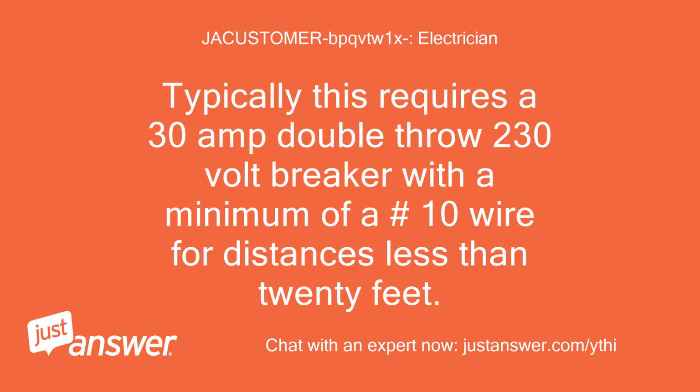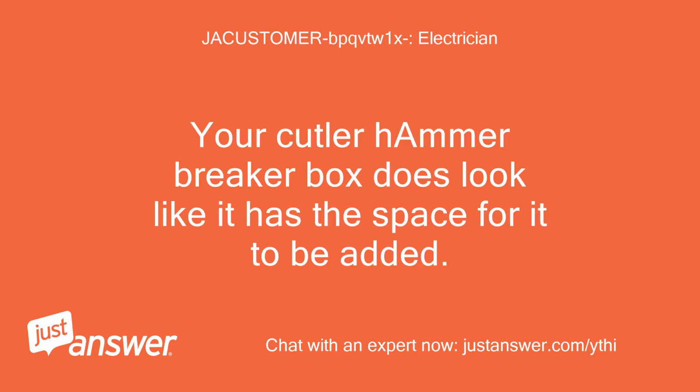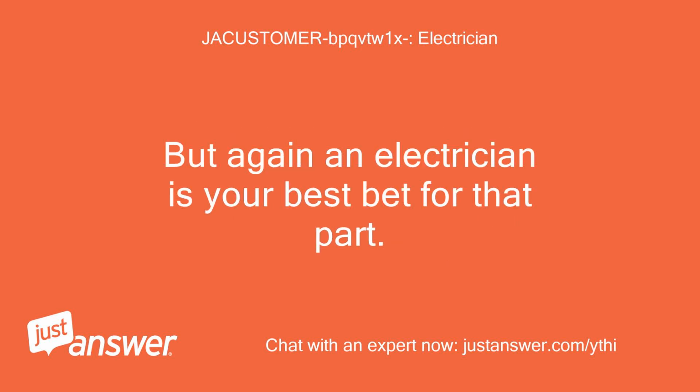I would recommend hiring a qualified electrician to add a circuit for your new heater. Typically this requires a 30 amp double throw 230 volt breaker with a minimum of a number 10 wire for distances less than 20 feet. Your Cutler-Hammer breaker box does look like it has the space for it to be added. But again, an electrician is your best bet for that part.